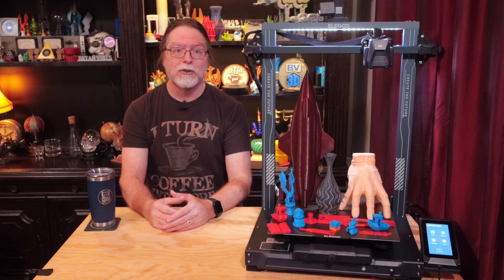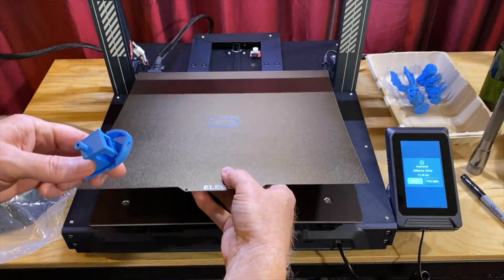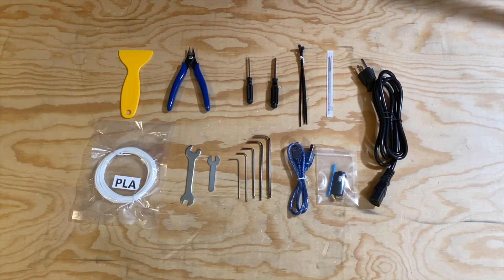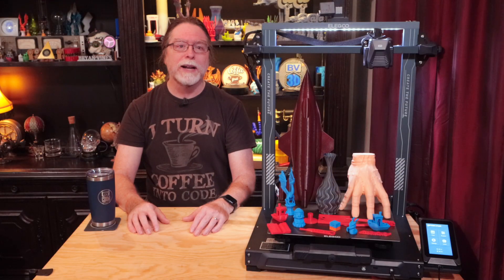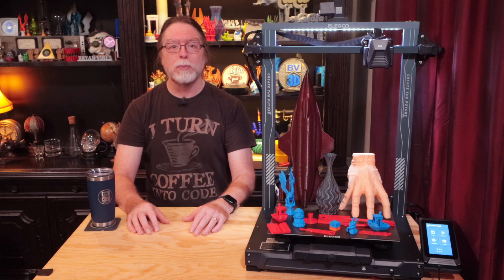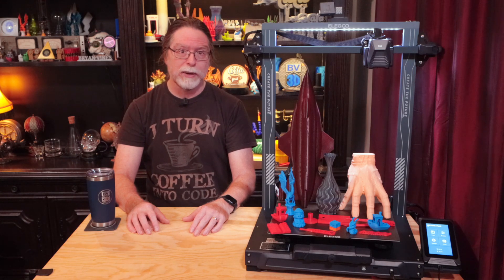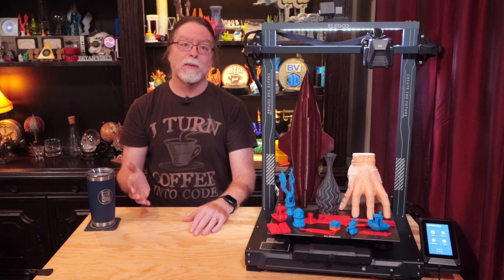On the bed is a magnetic flex plate with a textured PEI coating. Flex plates like this make it super easy to remove models when they're finished printing. It also comes with a usual assortment of tools, including flush cutters, a USB card reader, a microSD card, and a minimally useful sample of filament. On the microSD card, you'll find a PDF user manual, a folder with Elegoo's version of Ultimaker's Cura slicer for Mac and Windows, and a pre-sliced Buddha model for a test print. There's also a really well done video showing step-by-step how to assemble the printer, adjust the eccentric nuts on the V-slot wheels, level the bed, and start a test print. I recommend watching that video as a quick guide.